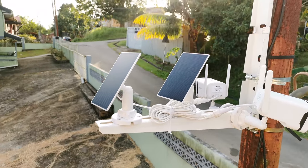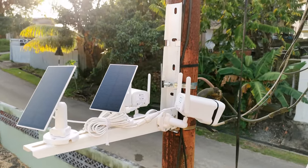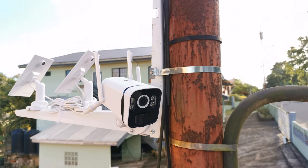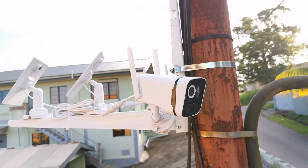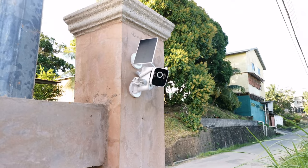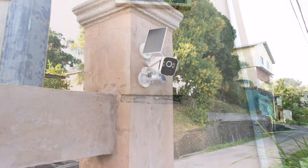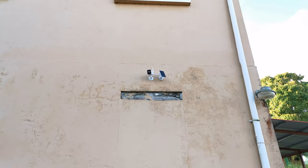The installation process was quick and easy, and I really enjoyed the wireless modern solar panel configuration. Once you have properly installed your cameras and solar panels, don't forget to press the power button to turn them on and replace the protective waterproof cap. Sometimes if you turn them on too early and take a long time to pair them to the NVR, the NVR may not recognize them right away and may require you to restart those that are not detected. However, once detected they will remain paired to the NVR.